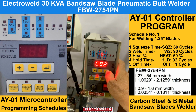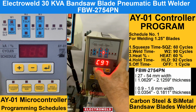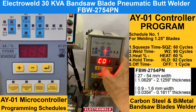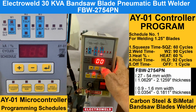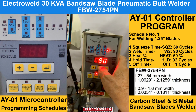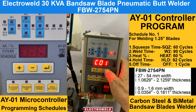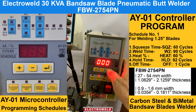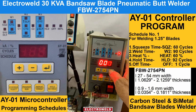And this is a cool time that is not required, so you can keep it 0. This is all 0, 0, 0. Then this is the hold time, we kept about 92 cycles. It can be decreased or increased. This is the off time, you can keep one cycle. This is 0. And this data is set for welding 1.25 inch bimetal blades.